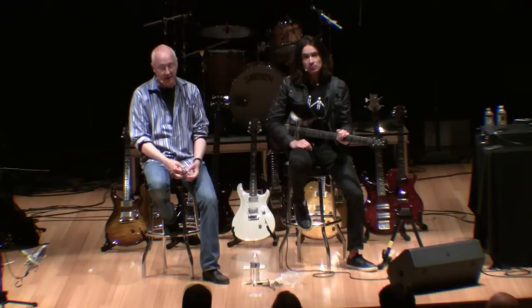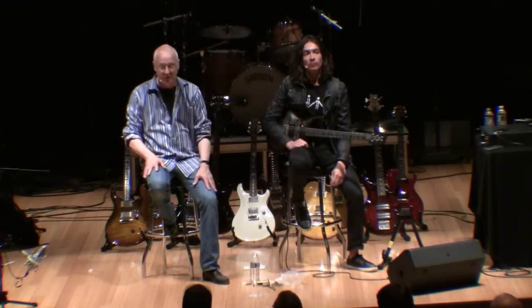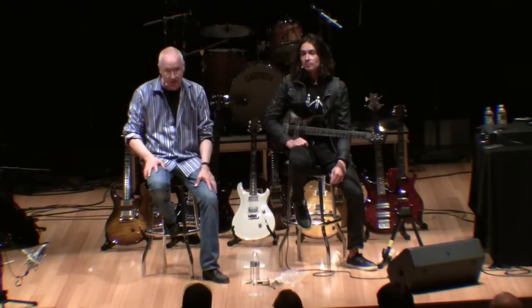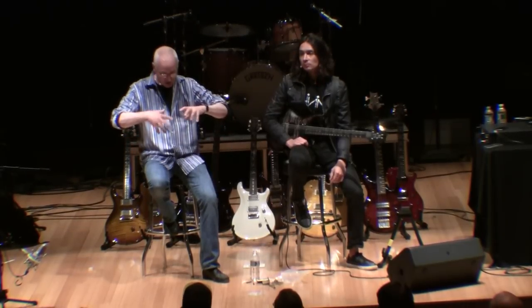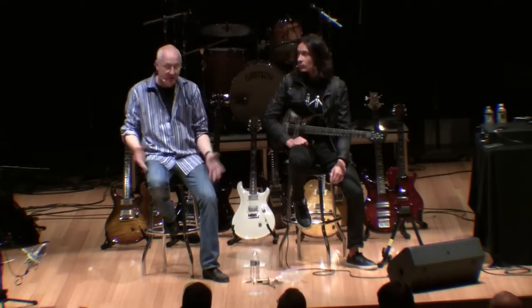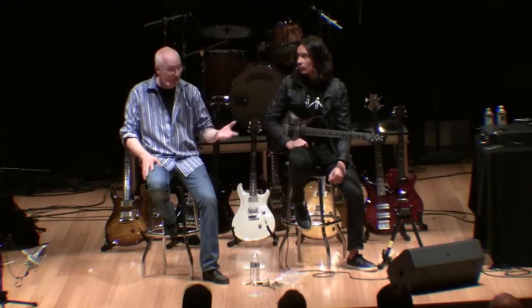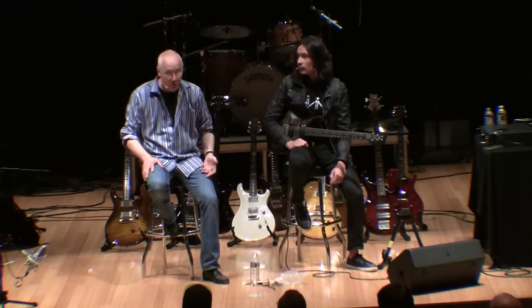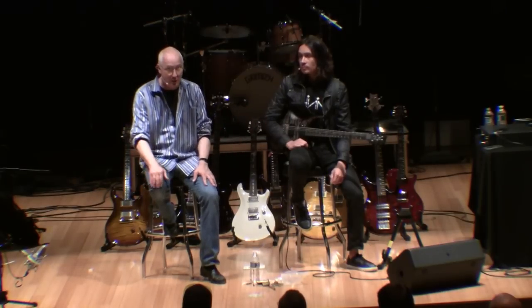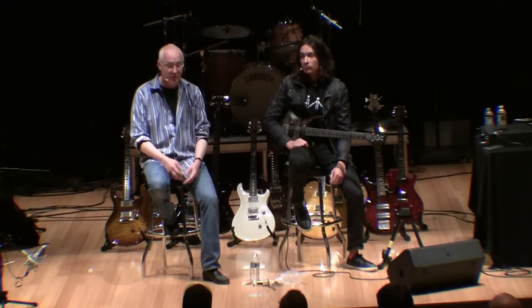I have taken necks and taken finish off other brands and literally had them in my office, and they came apart. So what they have done is sealed the water in the wood like a swimming pool. And if you take the finish off, if you look at Stevie Ray Vaughan's guitar, a lot of these old guitar players, the finish on the neck has been gone for a long time. Those things have been through a lot of drying periods of summers and winters, and they've dried out really well. It makes a difference.